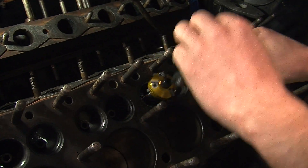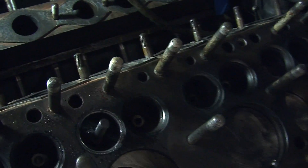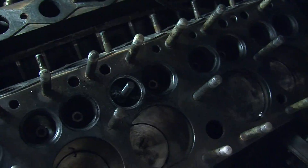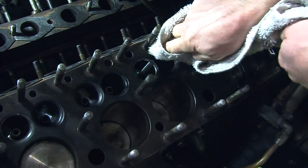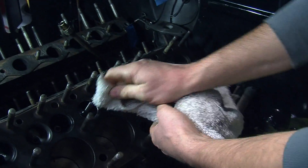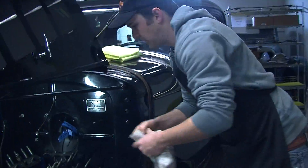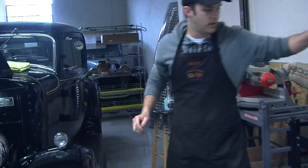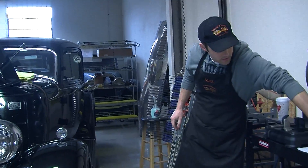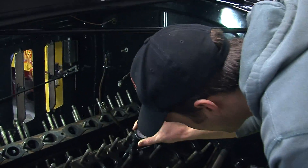Alright, that'll be hit. Take that guy off — you can see a nice shiny seat now. How much material did you take off? Are you worried about shavings getting down in there? These cutters are much, much cleaner than a stone — they don't throw grit everywhere. How much am I removing? Well, maybe a couple thousandths. I'm just kissing them off.